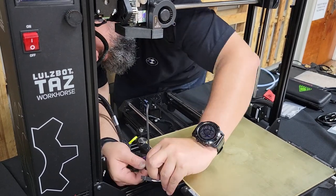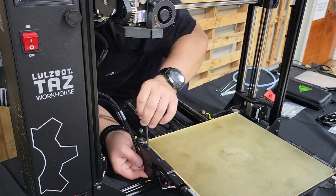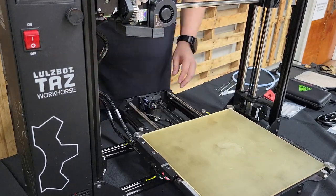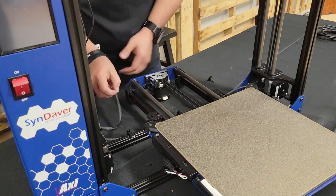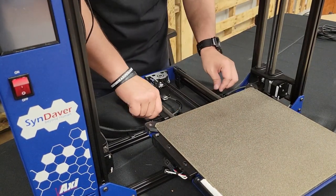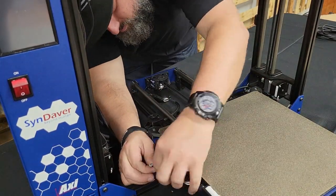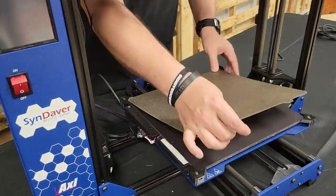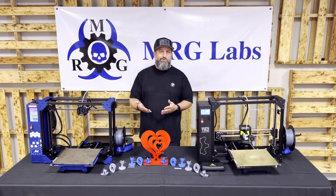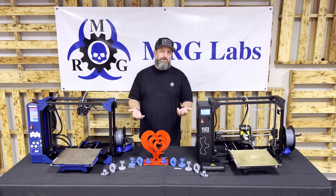Next, you connect the three connectors to the left side of the bed and then screw in the bracket to the side, pulling an Allen wrench through the top of the bracket to access the head of the bolt. Be sure to push the harness up towards the bed if it's down so that when the bed moves along, the wires don't get caught on the frame. Following that, you can plug it in and begin doing your initial calibrations. Note, based on experience, the power supply switches automatically, so these printers can both be used in 110 and 220 volt applications depending where you are in the world. The setup of the Axie is almost virtually identical, but a little bit easier because the bolts on the screws that hold down the bed have a broader head on them, which makes them easier to do by hand. Additionally, the Axie does not have those flexible straps, so just be sure to put the bolts back in the frame when the bed isn't attached.